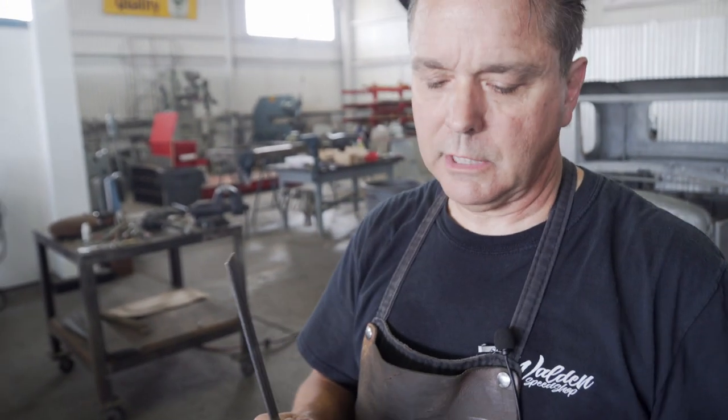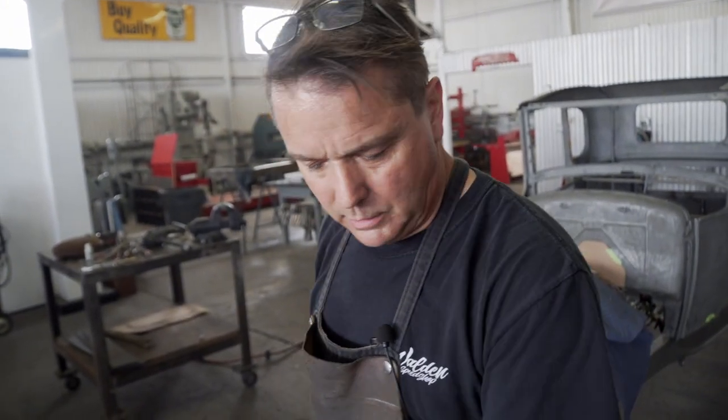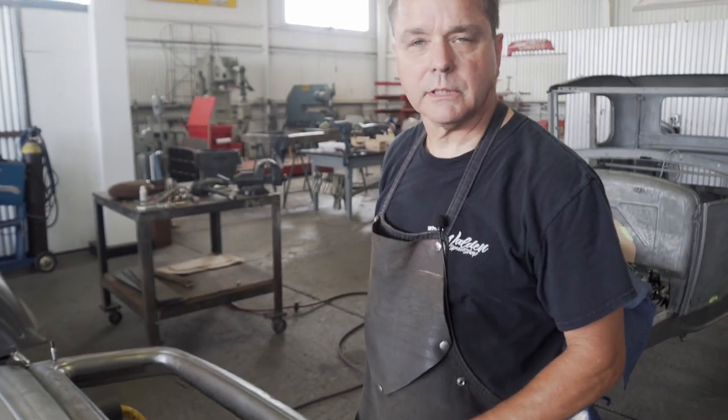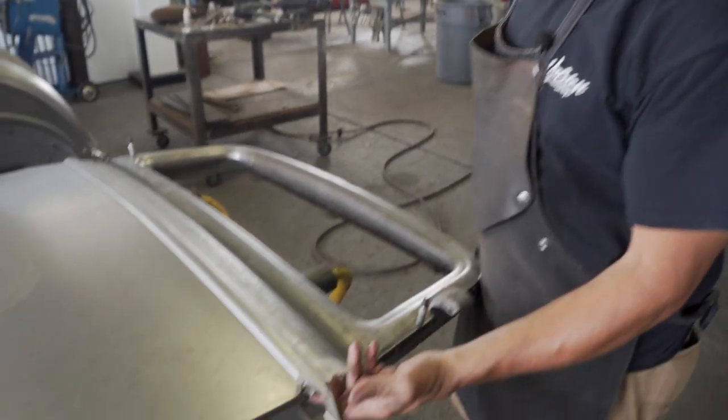All I'm going to do is take a piece of sheet metal, bend it 90 with a 3/8 flange, and just put it on in the spots I need. What we'll do is cut a strip that's that shape, and then we'll do some edge welding to finish out the flanges. We'll also do that on the flange here.